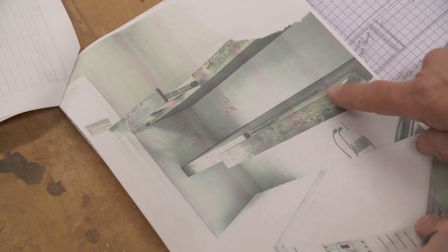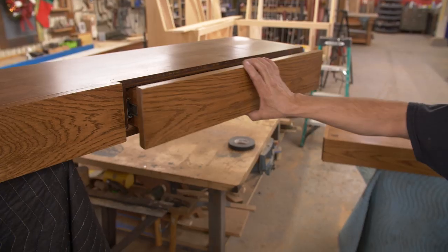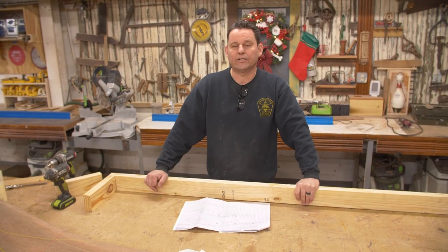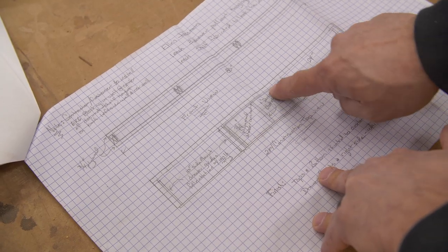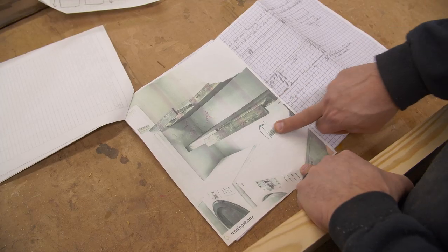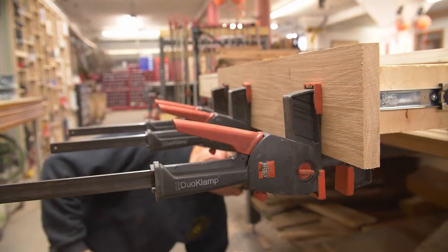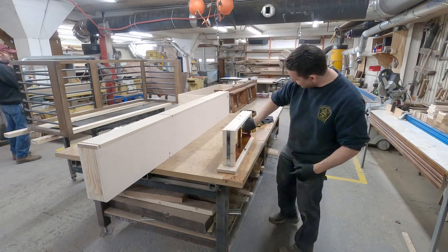The drawers won't have a bottom — they're just going to have a piece of one-inch dowel rod so that she can pull them out and hang clothes as she's pulling them out of the dryer. We're going to build a two-by-four frame and then clad that in three-quarter plywood. It's going into a corner so we'll have two exposed sides in white oak, and then the whole thing gets a medium brown stain and some polyurethane.